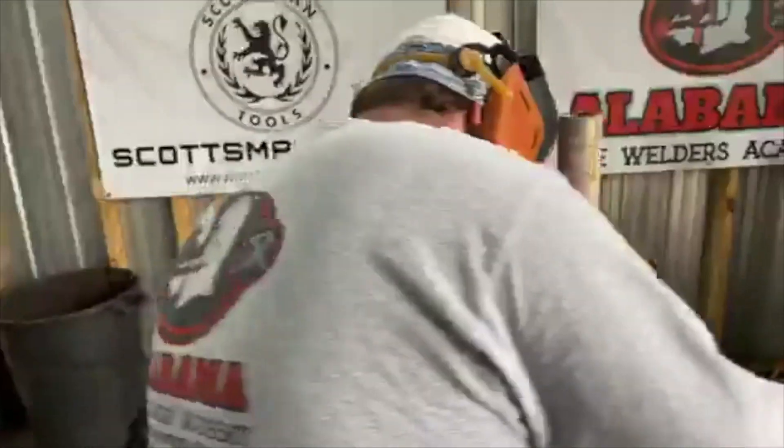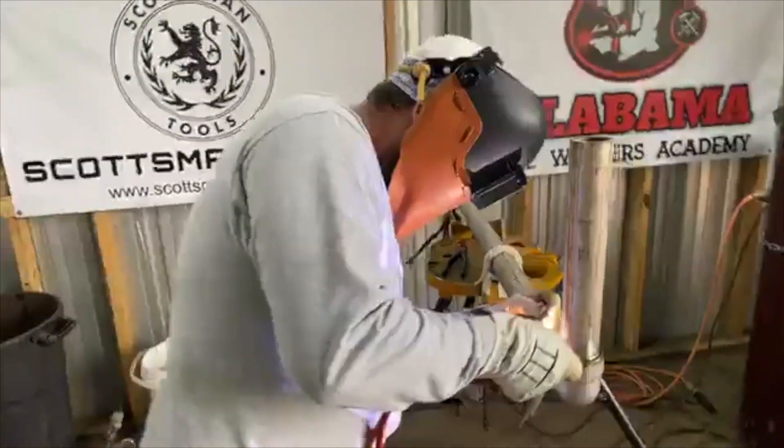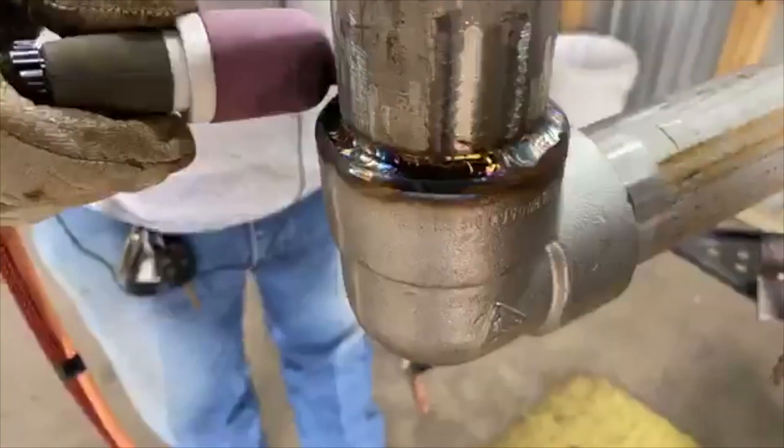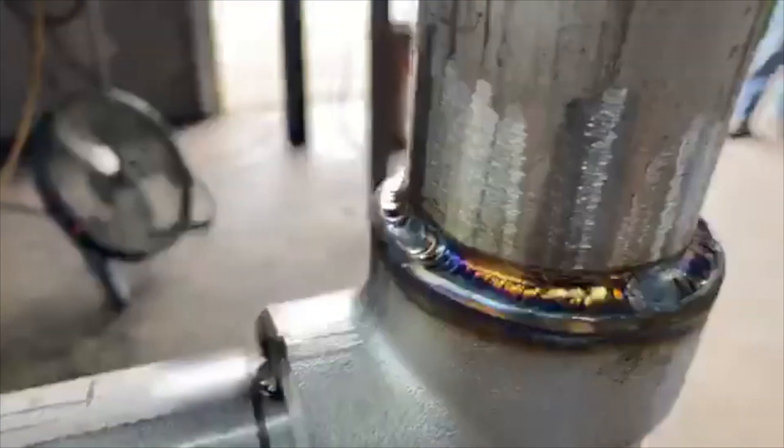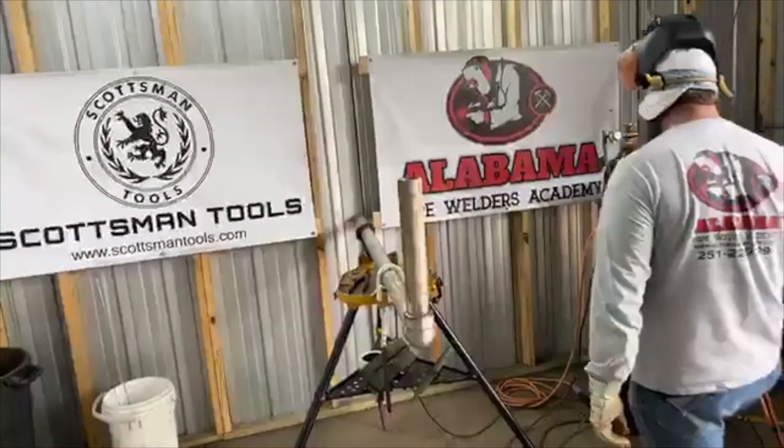Tell them I'm using a number eight cup. We're using a Miller machine right now, running about 125 amps. 1/8 tungsten, screw-in tips. It's starting kind of windy over here. Not bad color. I'm going to crank it up and do another pass with a 1/8 wire, then we'll get on to the tour.